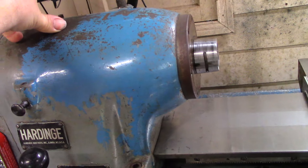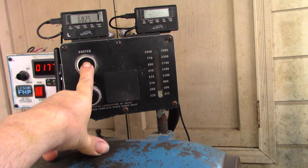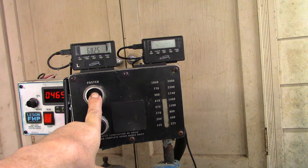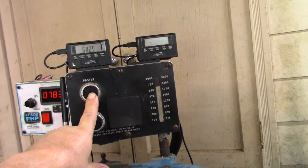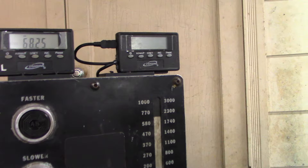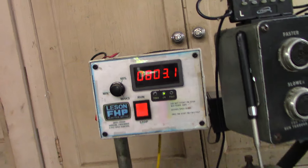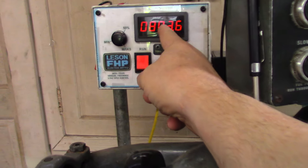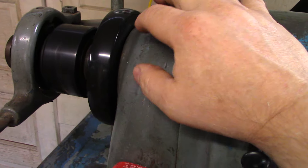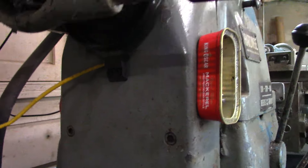The regular variable belt speed control works just fine. The RPM shown on the dial doesn't really coordinate with the RPM that it actually is. I added a tachometer to it some years ago that runs off magnets attached to this thing and a little pickup sensor I made.